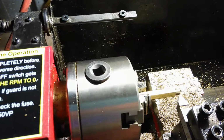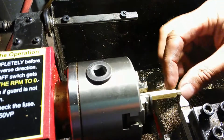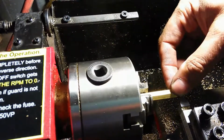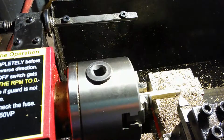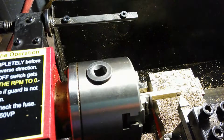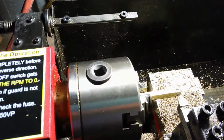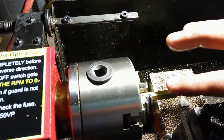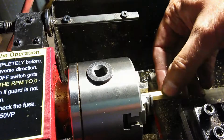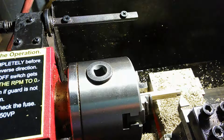There might even be another term for it, but what I do is I find where the bottom part of this is, and then I go in however much the length of this has to be, and then some, to make up for the blade on the hacksaw I'm going to cut this with. As I said, if I had the quick release chucks on here, I'd just throw that on and cut it off, because it'd already be set and consistent every time. But I don't have those right now, and I don't want to have to align a parting tool to cut into this material properly, because it's got to be exactly centered for that tool to work. Otherwise it'll bind, it'll move, it's a real mess.